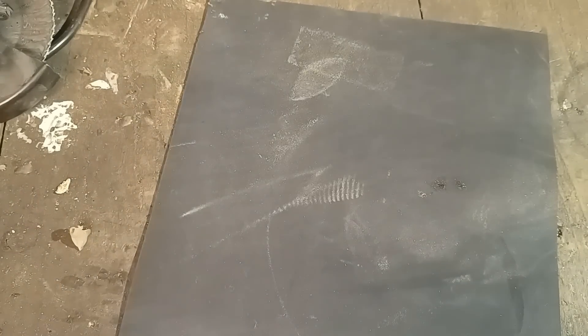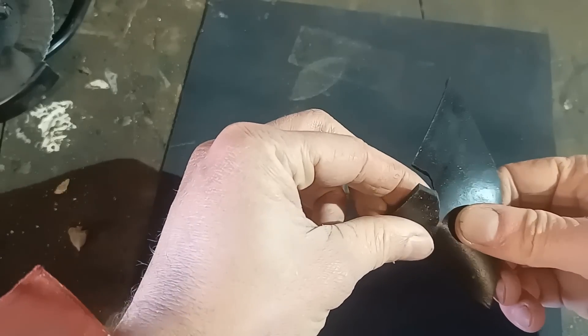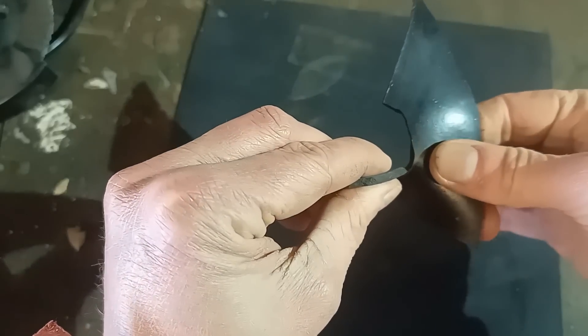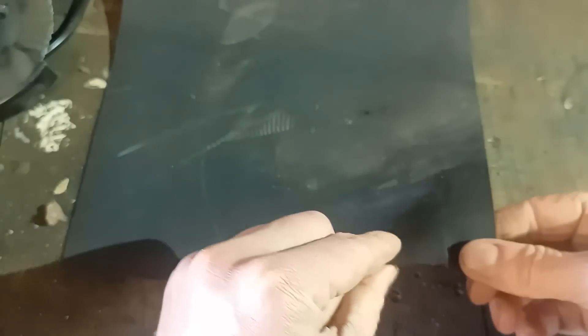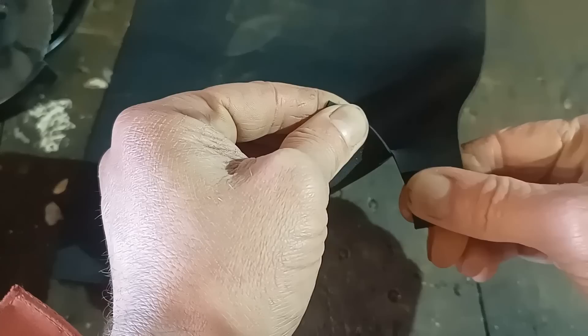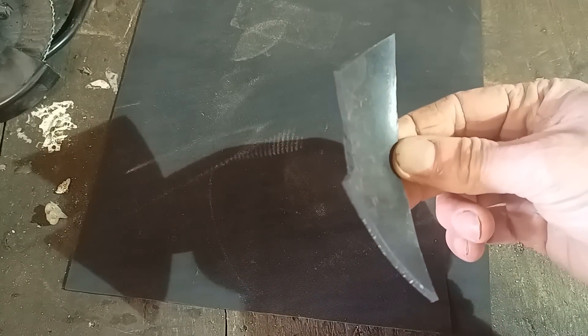It's been running for 10 minutes and the four-millimeter EPDM rubber has just ripped. I would say the last test run was a bit inconclusive — this is an offcut of the material I made the diaphragm from, bought as EPDM four millimeter. I put a nick in it and ripped it and it's fairly easy to rip, which makes me wonder whether it is what it says it is since I bought it off eBay. I also got some 1.6mm stuff but unfortunately didn't buy enough for the job — putting a nick in that, it's decidedly harder to rip. So the test is a bit inconclusive really.